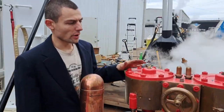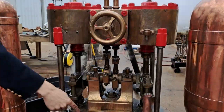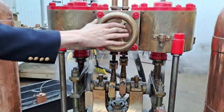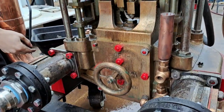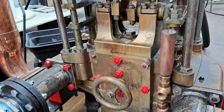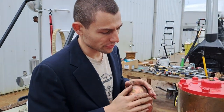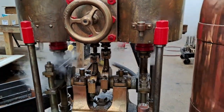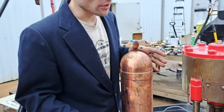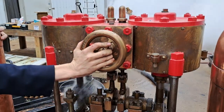This is a Merryweather Double Simple 2HP — really interesting. The throttle is in the chest and so is the control valve discharge. It's also got two engine-driven pumps on it. As you can see it works; it retimes and did some other things. We're not going to run it for very long because we don't have enough hose and adapters to get water flowing through the pumps. It does pump, but you don't want to run one of these things without water — they're water-lubricated pumps and packing — so we're just going to shut it off.